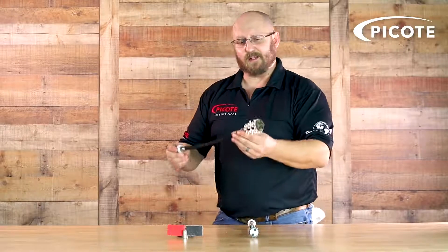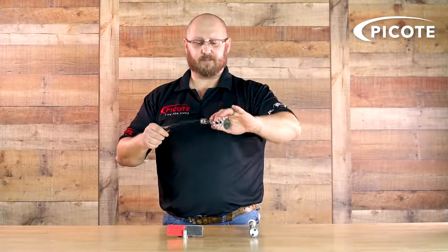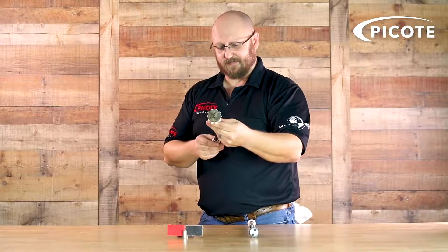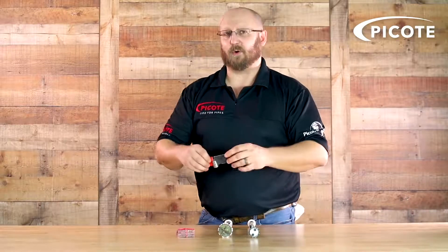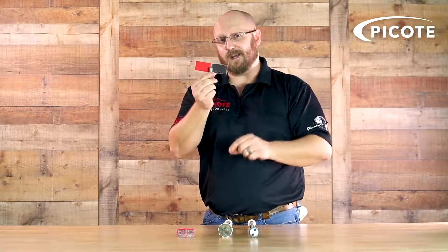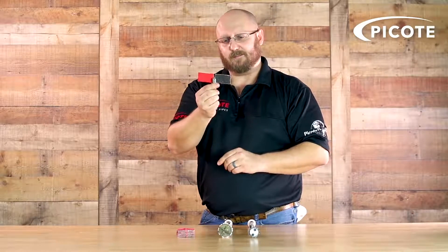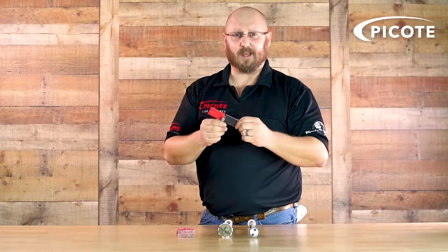For reinstatement through a two-inch P-trap, we have the new twister flexi for two inch. It's a highly flexible cable encasing that will navigate right around the two-inch P-trap to do a two-inch reinstatement in CIPP liners. After reinstatement with the twister, we use our smart cutter hub to grind the opening completely open. This is our new mini cleaner smart cutter hub, specially designed with a shorter body.